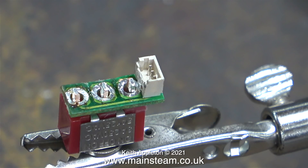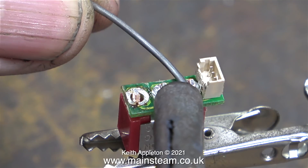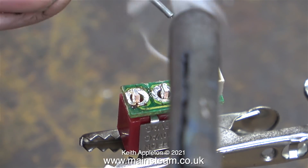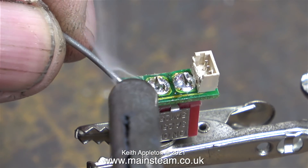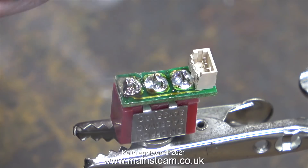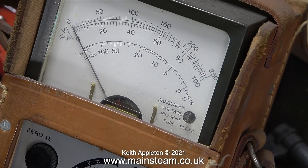In order to fit the circuit board to the new switch, I had to grind the terminals down a little bit, and here I'm re-soldering it. I'm sorry that in the video you can't see the sharp point on the soldering iron. There was a bit of a problem though — the circuit board was double-sided, and I just could not remove the solder from the inside part of the circuit board. When I pulled it off the switch, it pulled the track off the board. This wasn't too much of a problem, except that I had to solder a very fine wire from the rear of the centre pin of the connector to the centre pin of the switch, and this worked out okay.